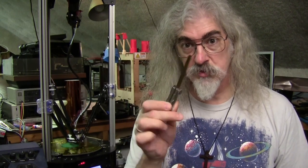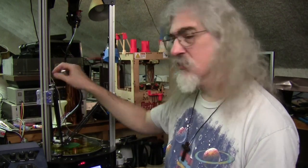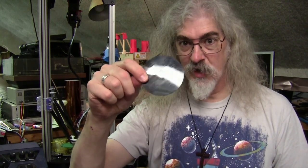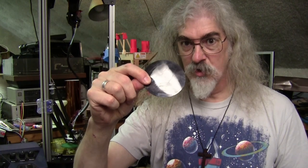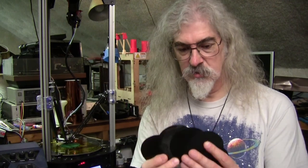I'm using 0.203 millimeters, or 0.008 inches — that's the one I'm using. Then I tweak it just a little bit. Once I get everything flat and level, I'll adjust the screws just a quarter turn at a time. You're making such a small difference there that it's almost an aesthetic change rather than a mechanical change in how the first layer adheres. But my first layer is super critical — I need that super glossy, pretty finish on the drum heads, so I kept dialing it in until I really got it right.